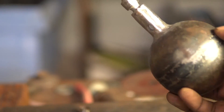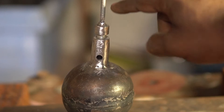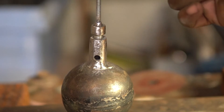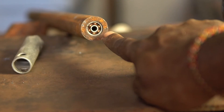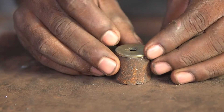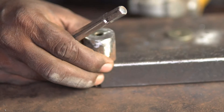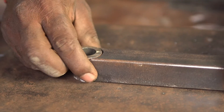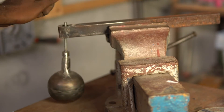After inserting the ball bearing on top, the setup should look something like this. This metal sphere will hold water, and when heat is applied it will turn into steam and come out through the three small holes on top. The ball bearing on top enables the rotational movement to be as smooth as possible. I found a metal pipe whose inner diameter matches the outer diameter of the ball bearing, so I cut a one-inch piece and welded a washer on one side — the washer's inner diameter is slightly bigger than the inner diameter of the ball bearing. This ball bearing holder is then welded onto a metal pipe, and after inserting the setup onto the arm of the stand it should rotate and spin freely.